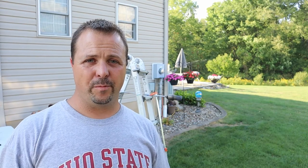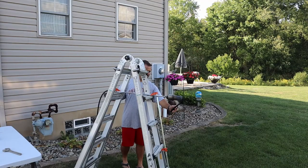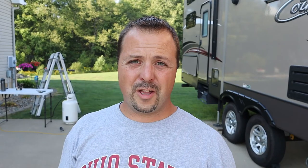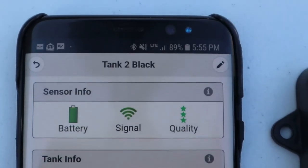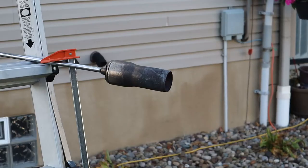With the inline gauge removed, I'm going to go ahead and relight the torch. You should be able to hear it running now — it's burning much hotter than it was last night. Last night I let it run for about half an hour and barely saw any change in the ultrasonic level or the tank weight. Now that it's going on high, we should see the tank level start dropping quickly, and we'll be able to watch the magnetic gauge change color as the temperature drops.